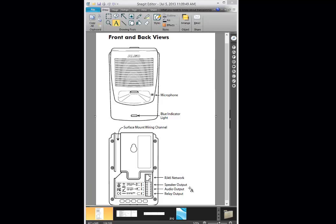Now, one of the additional features is that you can configure it to have talkback. So these can be small paging speakers within an office that can audibly alert and also have two-way talkback as well. And the nicest piece about this is the fact that they are SIP. So when you configure them, they go on the ShoreTel as a SIP extension, and you can configure them to twin on somebody's extension.